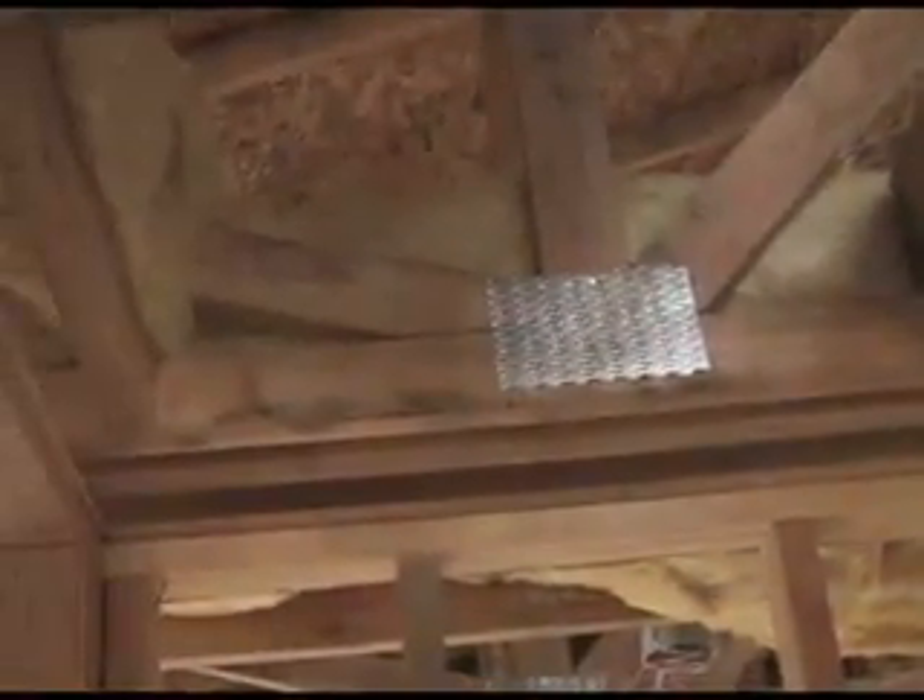Now, with QII, all the exterior walls or interior walls need to have the insulation in full contact with the plates too, on the exterior walls and any place. So in this particular case we've got a problem here. They need to go ahead and drop some insulation to take care of this little space.